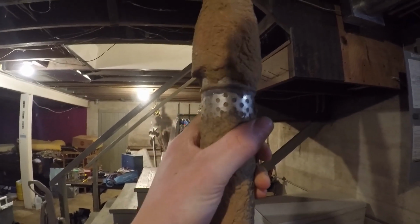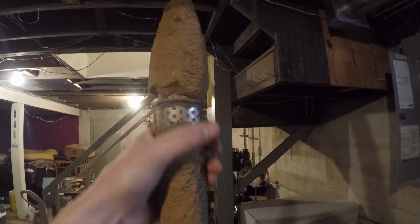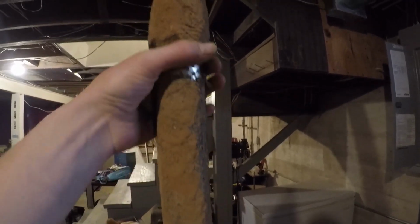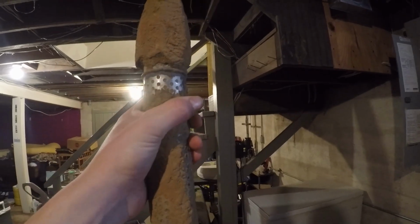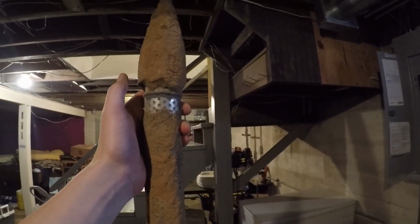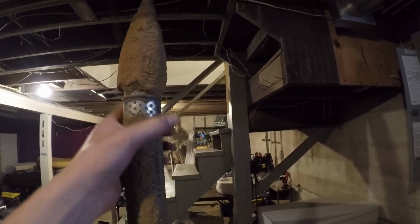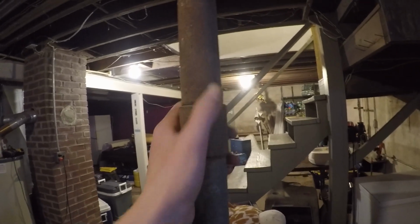So whenever you're pulling this out of the ground, you're not just pulling the pipe out, you're pulling all the sand that's packed around this pipe. You've got to get that to break loose so that you can pull this out of the ground. And the new sand point that we put in does not have this big thing. It's just nice and smooth going all the way down,